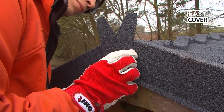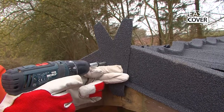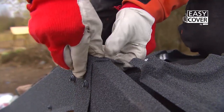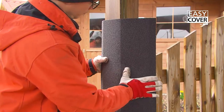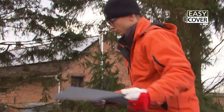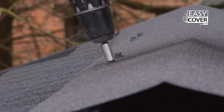Stop the end of the ridge with the end cap for ridge. Place the V-shaped notch at the same level as the top of the roofing and attach the piece. Fold back the two upper vertical pieces following the direction of the roof. Then fold the ridge panel properly over a stable support. Spread out the ridge panels evenly over the entire width and attach on the edge of the two barge boards and on each overlap.